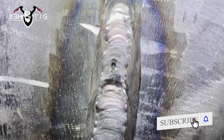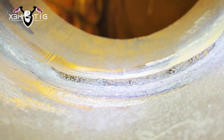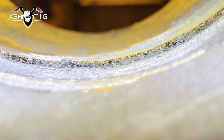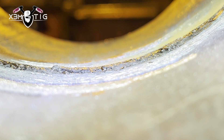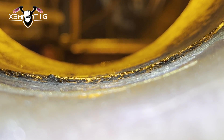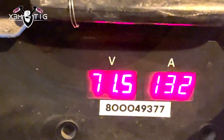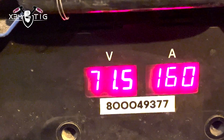That's it for the root. As you can see, the widest part doesn't look beautiful, and it doesn't have to — it's a root pass. As long as it's good and healthy from the inside, with enough meat above the edge, that's a good root. If you have an x-ray or it's a repair from an x-ray, you're going to pass for sure. It requires a little more skill, especially with a wide gap. If you have a repair, don't try to open too wide — try to keep it within your rod size, like 1/8 or 5/32 max. If you open too wide, this is how you reduce that gap down to your desired size — the one you feel most comfortable with.